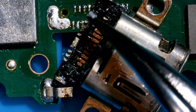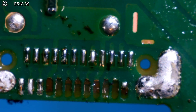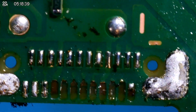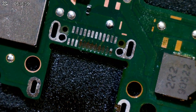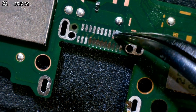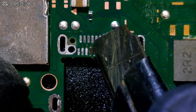Maybe I'll try it next time without applying the low melt solder. Now I have to find out where each of these pads go. This one — I think it's the via, it's not going to that pad. The three on the end I have no idea. Not great at all. I'm going to have to attempt this sooner rather than later. Let's clean up everything first. Now we need to run jumper traces from each one of these. I'm just going to expose each one as best as I can. This is going to be a slow and painstaking process.